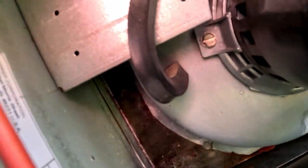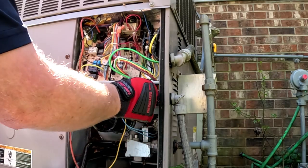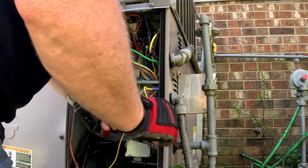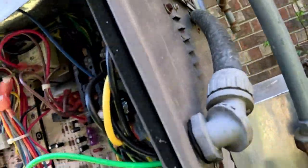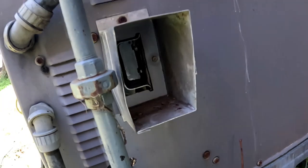The hose port may be plugged up — meaning the wires are plugged on there. The hoses are connected and the motor is running. Let me disconnect the call for W. I want to look in here and make sure all my blades are on that wheel — I felt like I had some air blowing out of it. Looking at the carrier package unit, you can see the wheel back there and it does appear all the blades are on the wheel. It's got some light rust on it, but I don't think that's going to cause this problem.